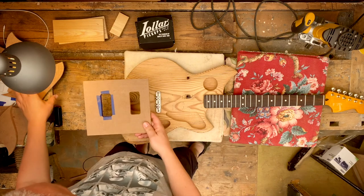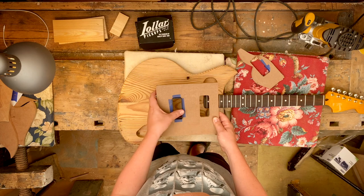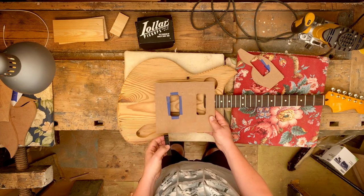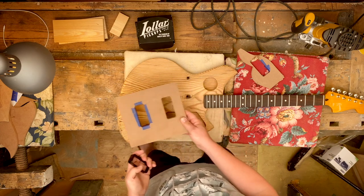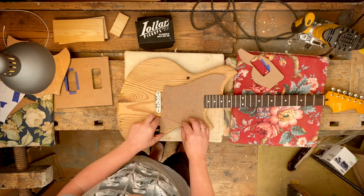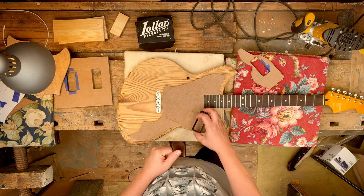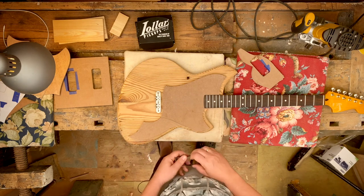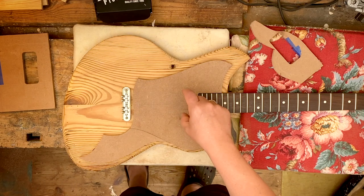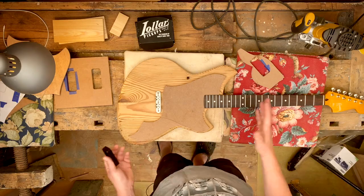I've tried to do some different ones. This one is actually pretty close to being good, but where should I position it? All of that could be solved if I make a template for the pickguard, and I tried to do a lot of those. I'm happy with this one — now I can determine where to put the pickups. So what I'm going to do now is route out these two holes and use this template to do the cavities in the body. That's the plan anyway.